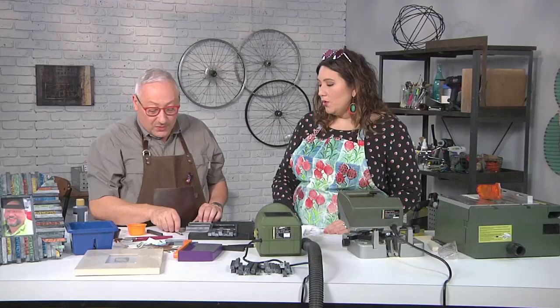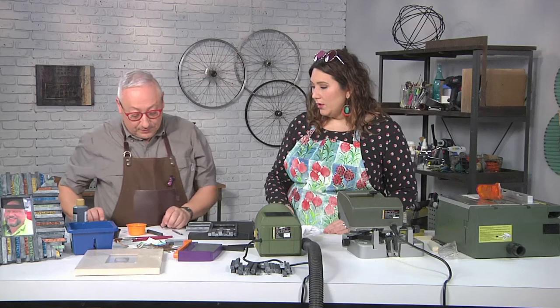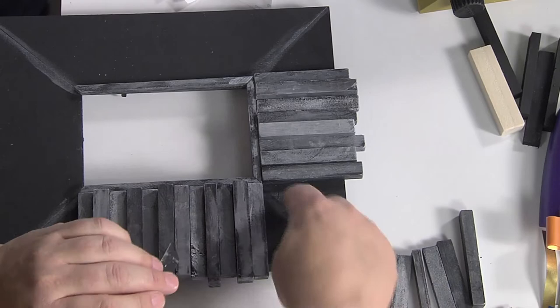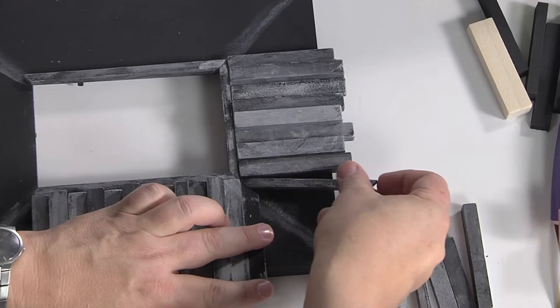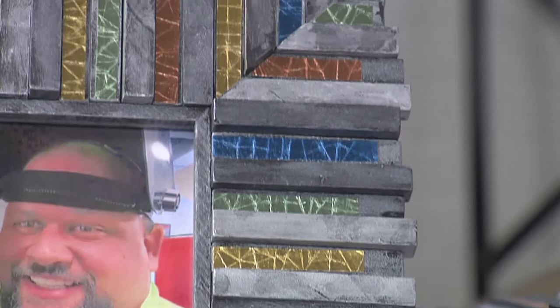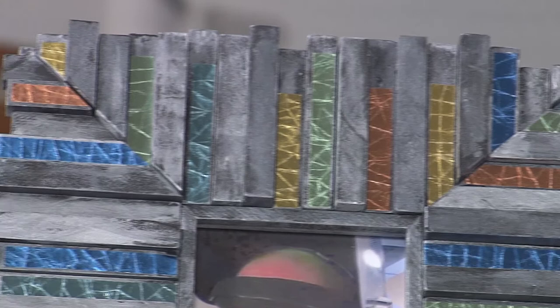So I was going to ask you, how do we deal with the corner areas? Well, we cut one mitered piece already. I would put all my double-sided adhesive tape, then put the first one, then put a second one. And I marked that one's too long. So I'd mark it and go to the chop saw, cut it again. So you're just adjusting them smaller and smaller so that they'll fit in a tapered way into that corner. And I'm sure you could measure it and know in advance, but it was a lot easier to just wing it.